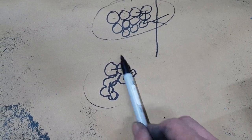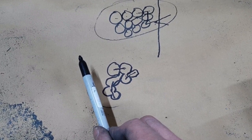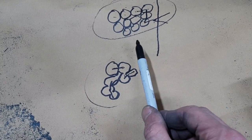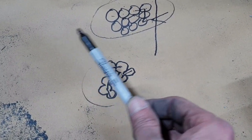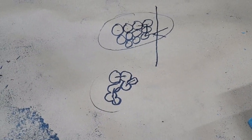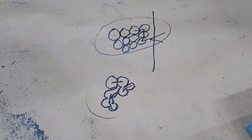If it's below that, you need a more solid foam, just because the temperature is lower, and it will behave the same as this. So there is a variation in the foam types because of the temperature differential, or delta, but that's a basic rundown on the foam. Now, just getting on from that, if you'll notice here on this part,